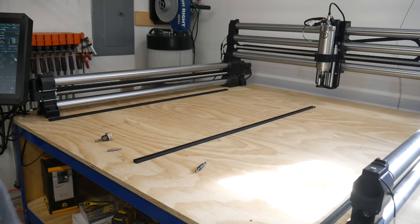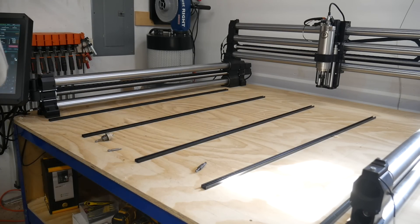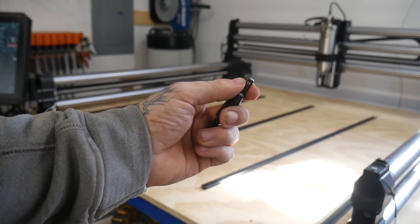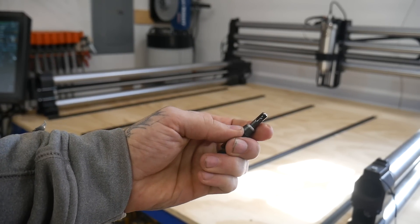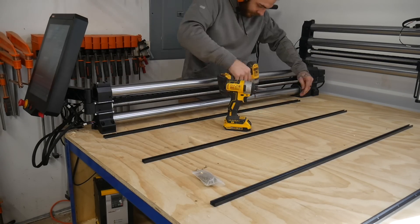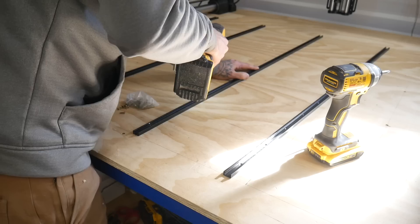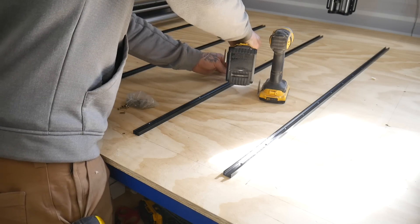I'm a T-track kind of guy so I don't want to mess with any of those threaded inserts, so we're just going to space these out evenly inside the cutting parameters. I also highly recommend you get one of these self-centering spring-loaded bits — they help a ton for drilling straight clean holes in the center of these T-tracks. Then I'll use two drills: one with the self-centering bit and one with a regular Phillips head. Exactly two ugga-uggas per screw and everything lines up perfect.